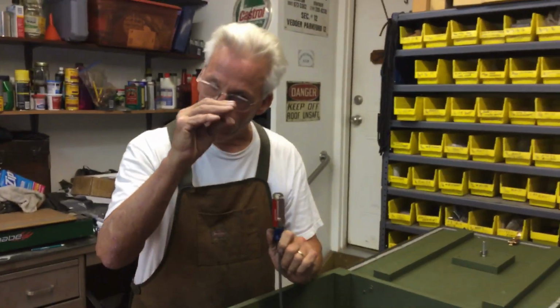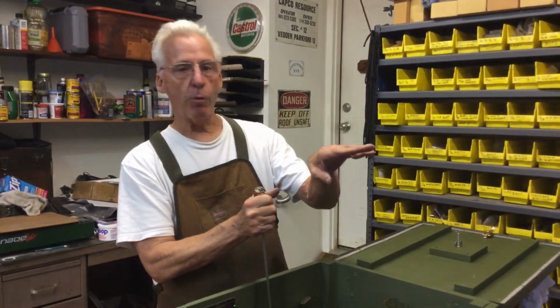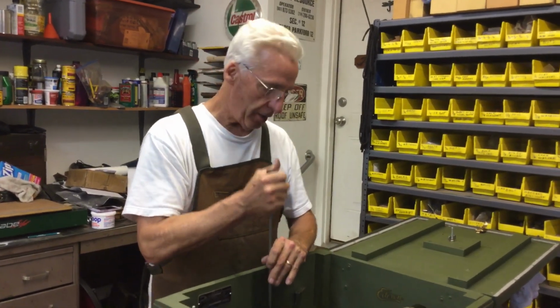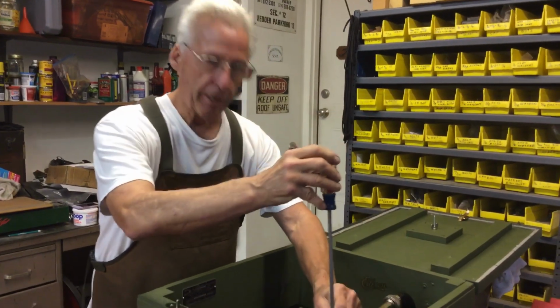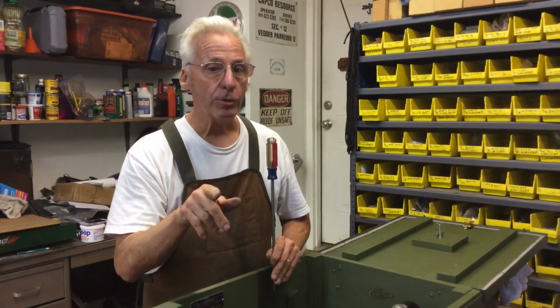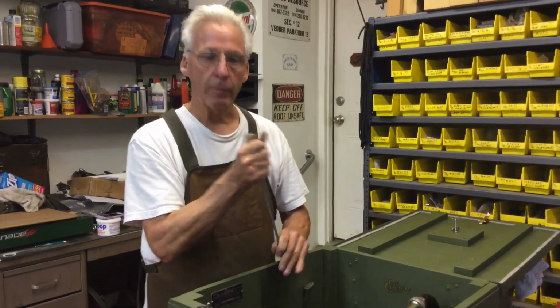And then after you get them loose, they're not snug, because if you crank this one down, it might lift the motor board this way. So you want to get a little tension here, a little tension here, a little tension here. You work your way around slowly. You make sure you oiled them too, a little light oil. And then you can tighten them down.